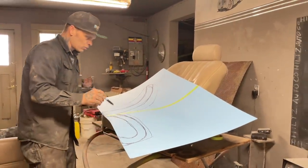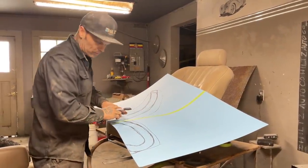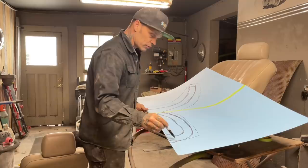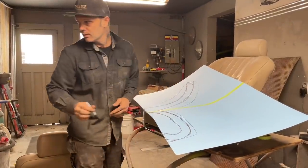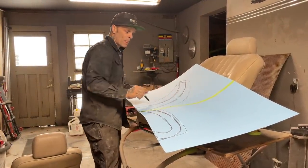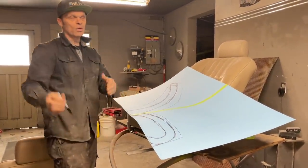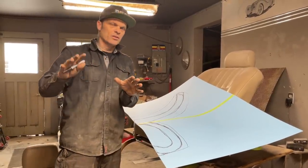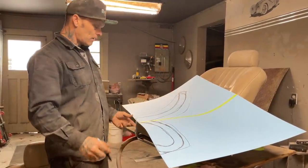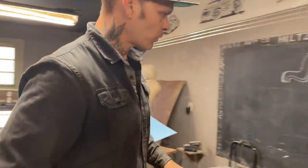It'll have to be made out of one piece of metal — we'd face the back side of it. Actually it'll be more like a park bench: you cut two metal sides — two pieces of one-eighth plate — and then sheath the back with a piece of metal maybe. Then we put foam on the inside. She wants no ribs in it because of the material she's going to use. I don't think we want it flat either — and this is how we're going to do it. So Autumn's going to cut this out and then we'll see what it looks like sitting in there.